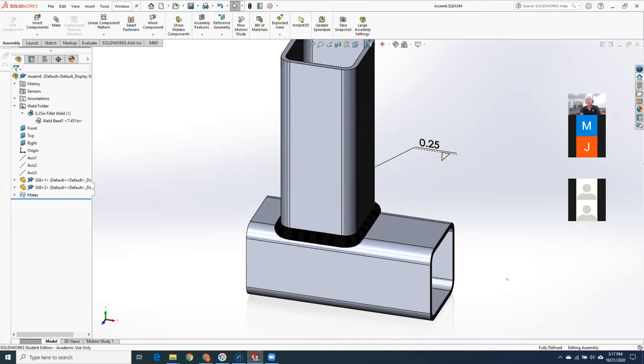So when we made that, we drew the solid model, we had it cast, and we left extra material on so we could then go and machine it off and have nice clean features, which you probably can't see. But for example, the tops of these hooks, that's all a nice clean machine surface. That way, when we put it in the engine, and I've got a Mach 1 airflow going through this thing at 1200 degrees, this doesn't chatter on the case and wear the case away, which would be bad at 40,000 feet.